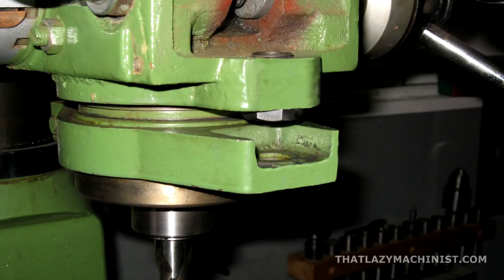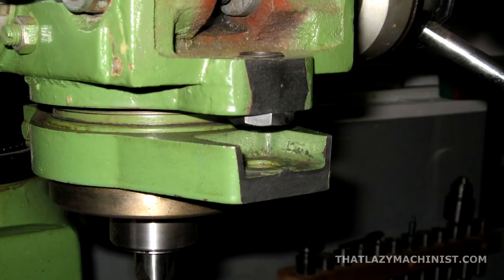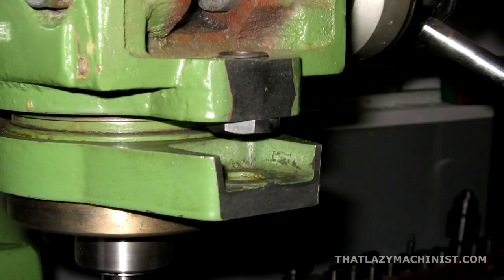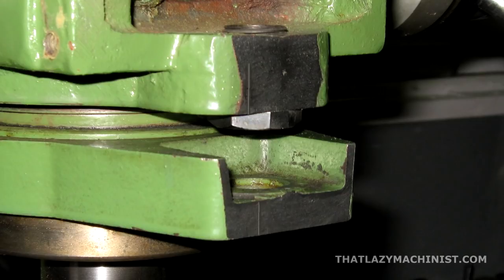We start by modifying the head casting and the spindle casting. We want to produce two flat surfaces that are going to be parallel and perpendicular to the table. The parts being modified are made of gray cast iron, and that material can be readily filed — just be very attentive. The perpendicularity of the surfaces can be checked using an accurate square projecting from the surface of the table, and you can use a dial indicator mounted on the table to verify that the surfaces are parallel to the X-axis. Once complete, lay out two lines that are perpendicular to the table and aligned with one another even though they are in two different planes.